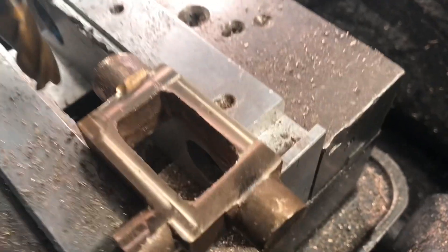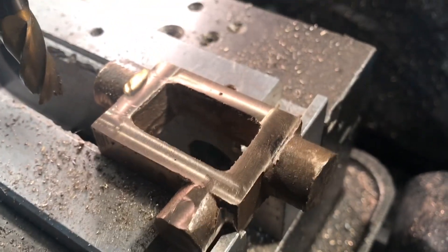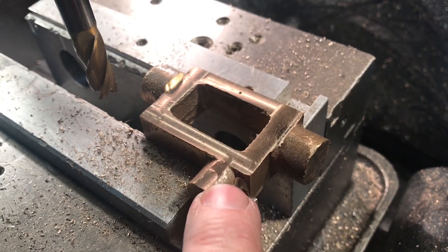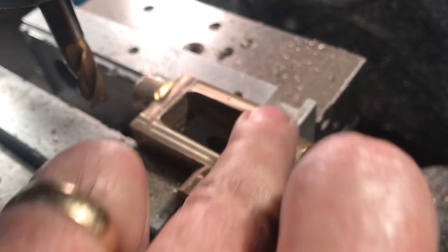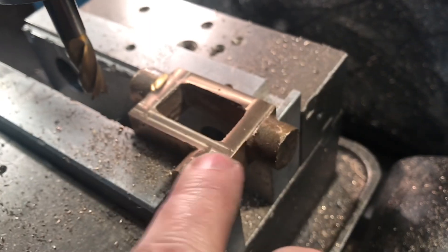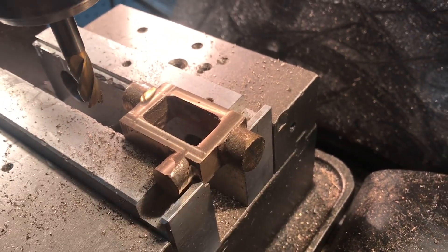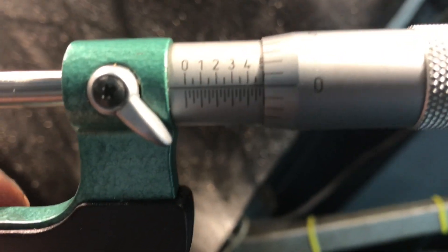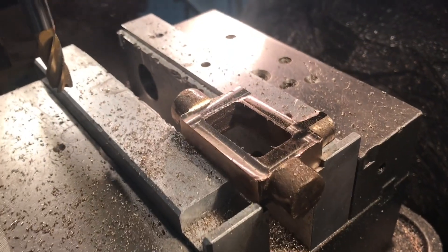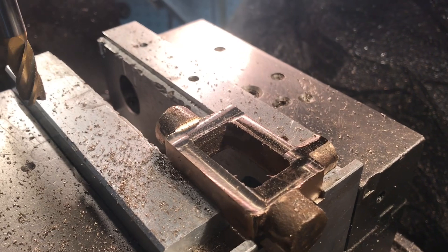The cutter did a really nice job. It's funny — bronze is a lot different from machining other materials like steel and cast iron. The metal moves a lot. Also, this boss here is supposed to get machined down to five sixteenths outside diameter. I went ahead and flattened it so it's on the same plane as the rest of the casting. Now I'll flip it over and finish the other side — I should have about fifteen thou or so to machine from that side to get it evenly cut down to the half-inch height. I just miked it — right at 500 thou. Lucky more than good. I'll take it out, deburr it, and do the other one tonight. Tomorrow night I'll come back and mill out the insides to the right thicknesses.